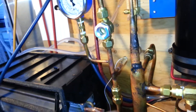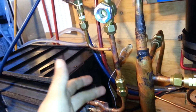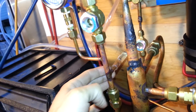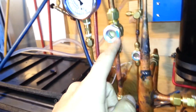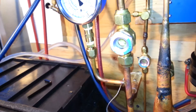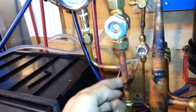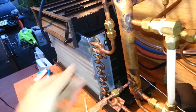What I ended up doing was changing my pressure gauge. I actually reoriented the sight glass — it was down here a little bit, so I put it on top. I'm hoping I can get a little better temperature reading with this thermocouple embedded that's floating right there in the pipe, so that if I start to see liquid there, I can close the gate valve a little bit and ease it back. Any liquid still in the column, I can get a reading on it. I'm going to put an accumulator with an embedded thermocouple that sits in the liquid at the bottom to get a better temperature reading.